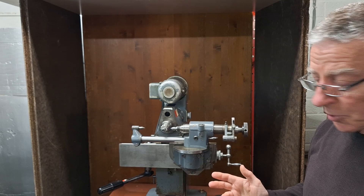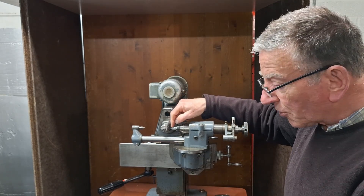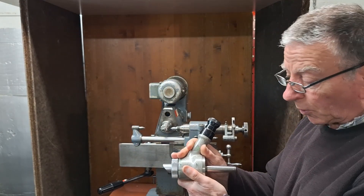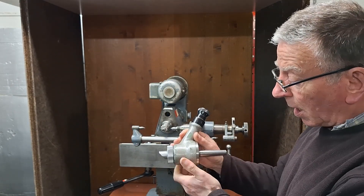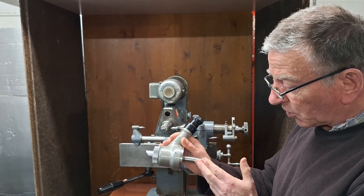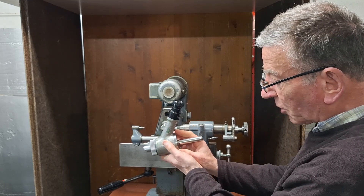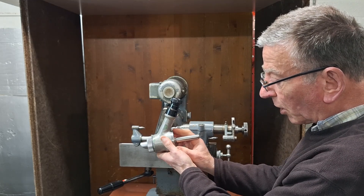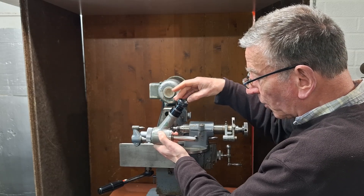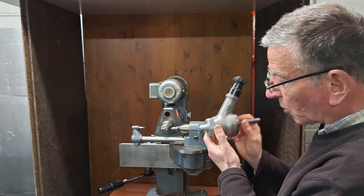There are a number of options for centering cutters. I've got a centering there, but you could replace that — if you had a smaller one that fitted this machine — with a centering microscope. This one's rather Morse taper two and physically just too big, even if I took off the rear plate and made a new W12 attachment. It's just physically too awkward and too large to be used on this machine because it would clash with the underarm support.